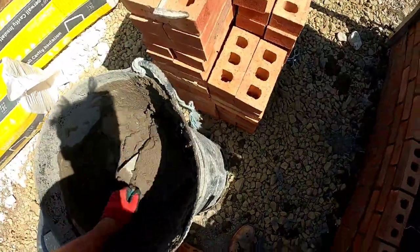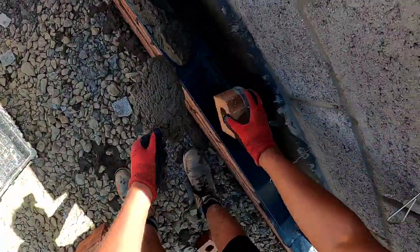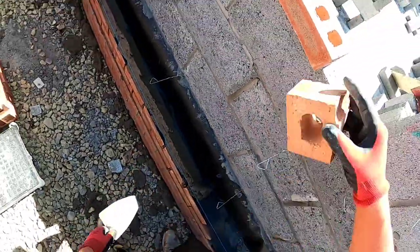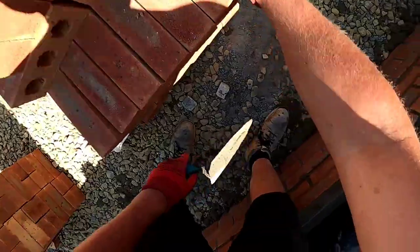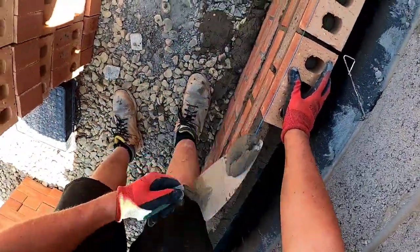I've worked open cavity, I've laid 1,000 or 1,200 bricks a day open cavity, and I've laid 1,000 or 1,200 bricks a day full fill cavity. To be quite honest, for stress management and just saving your wrists and arms and squinting looking down — it's just a lot easier to build with full fill. You just have to drag a bit of mortar off at the top of the insulation every few courses.